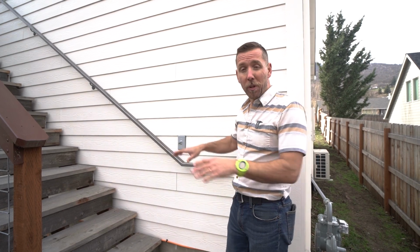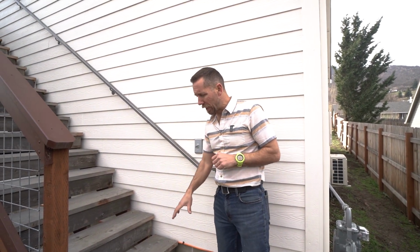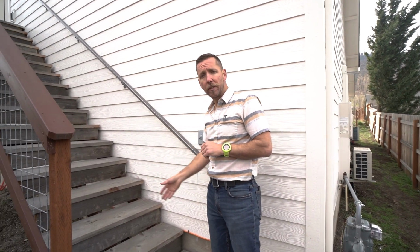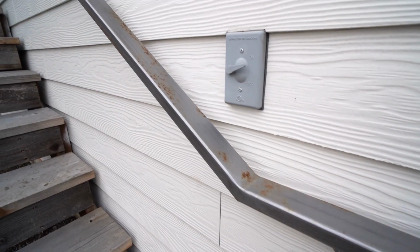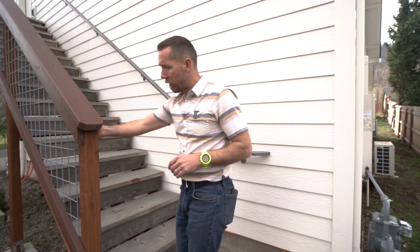So outside we're going for the barn look on this ADU. So talking real quick about what I do to save money is a simple staircase. These are just 2x12 pressure treated stair stringers, and then I use 2x12 cedar deck treads. This is a handmade grab rail out of 1/4 inch thick wall tubing, and then this detail is really affordable.